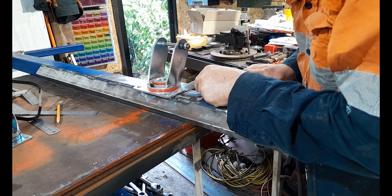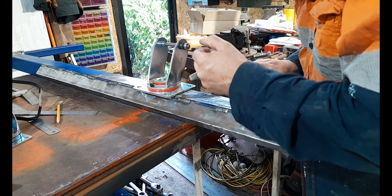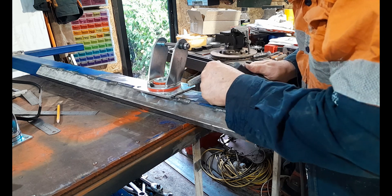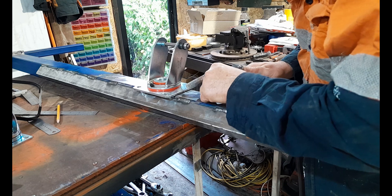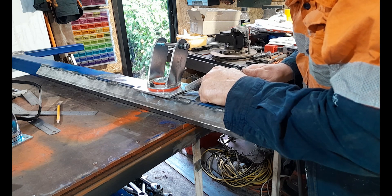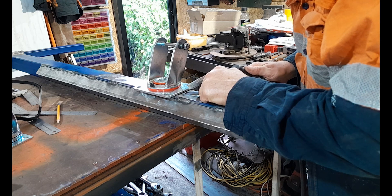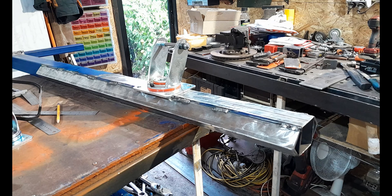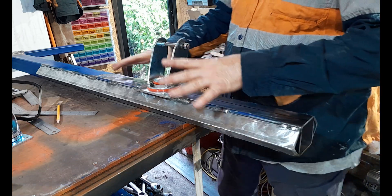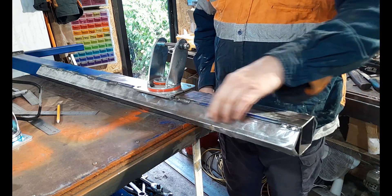Keep your heat concentrated on the caster plate and push your pool down into the mid frame with a weave coming back on itself. Get your welding gloves on to keep your hands cool and maintain good control on your gun. That's how you'll do it — it's going to look great and be effective, keeping your caster where it needs to be.